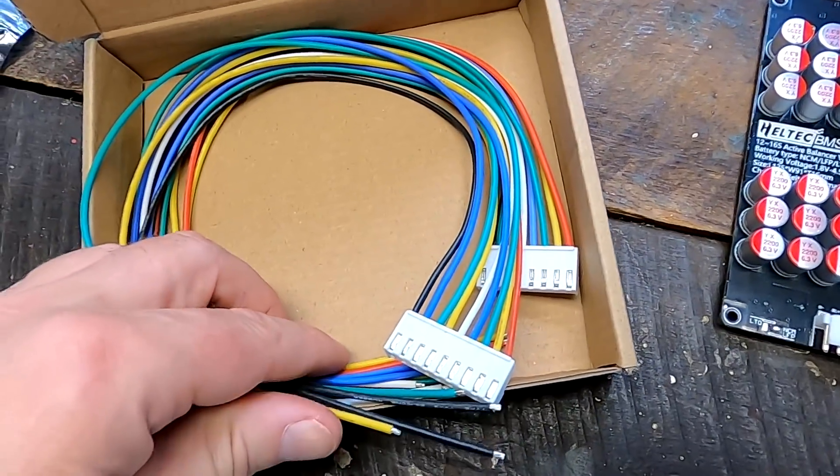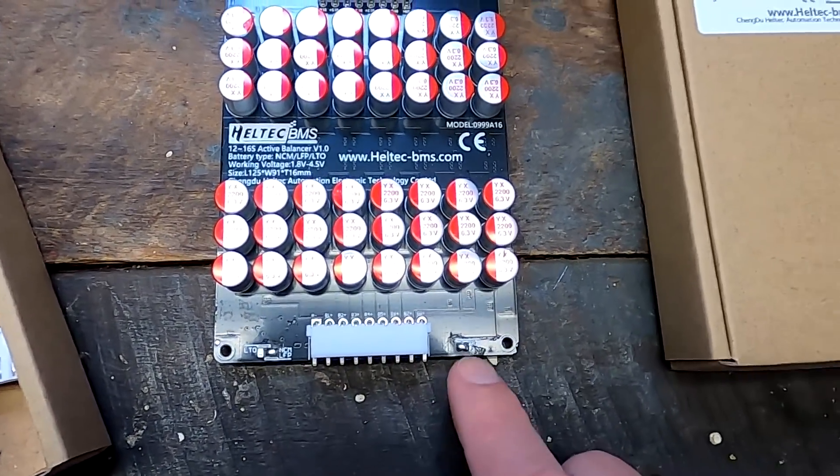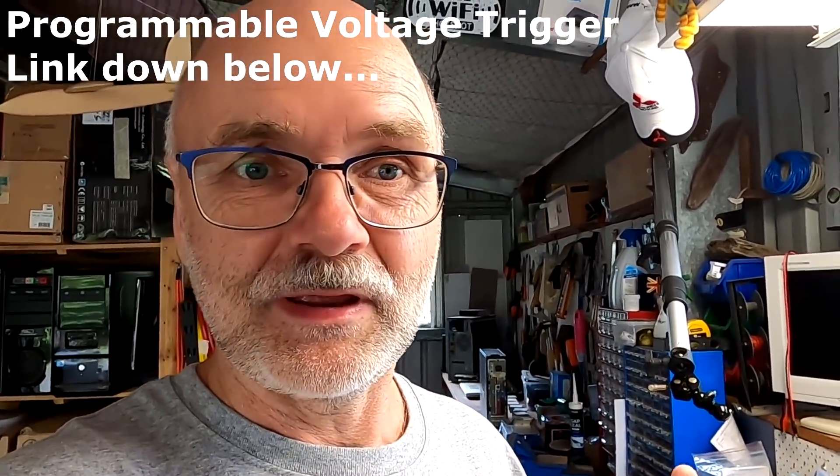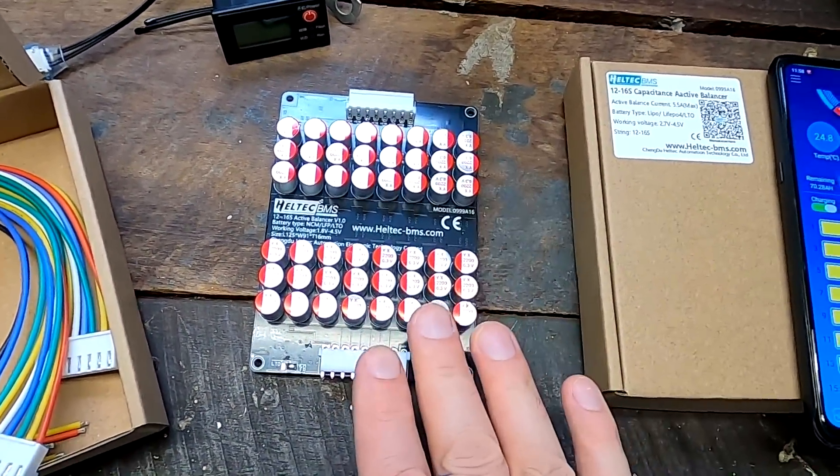You can keep all balance cables connected to the battery and just activate or deactivate the balancer with a switch. You could also find a voltage trigger relay on AliExpress so the balancer turns on at a certain cell voltage — this should only be 3.45 volts or above. If you monitor SOC via your BMS and see imbalance when the battery is fully charged, just flick the switch, turn on the balancer overnight, and turn it back off in the morning. You probably need to do this only two or three times a year.